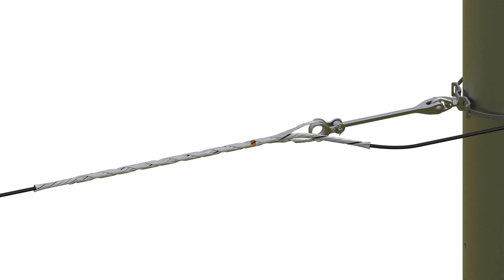While not always required, for form-wired dead-ends with an added layer of structural reinforcing rods, extension links are required, as the structural reinforcing rods extend beyond the applied section of the dead-end.